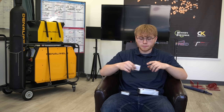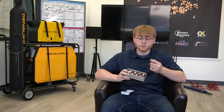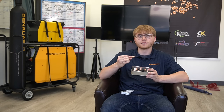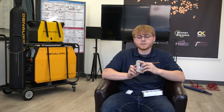Next we'll move on to our nozzle kit. The tips inside can wear after a long period of time from the natural friction of wire grinding them down. At lower wattages — 500 to 1,200 watts — you should get a lot of life out of these nozzles. On our larger models running closer to 2,000 watts with long seam welds of five, six, seven, even ten feet, you might notice the copper-bronze nozzles starting to deform, potentially falling into your puddle and contaminating your welds.